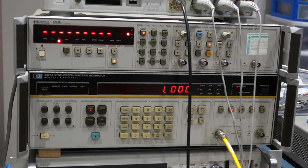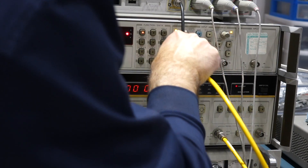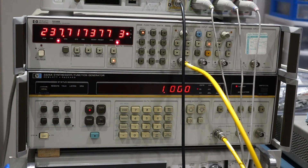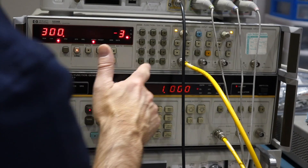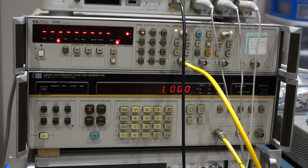Here's the problem of measuring low-speed frequencies accurately. If I measure high-speed ones — 10 MHz — all my digits are exact, plus or minus 1, that's normal. But now if I go to 1 Hz, I get only four digits of precision, because I'm just measuring one pulse instead of measuring 10 million. So to get the added precision I have to put a long gate — the longest I can do is 99.99 seconds — but that's only going to measure 100 periods. To get the same precision as 10 MHz, I would have to measure 10 million periods, which is 10 million seconds — way too long to make a measurement.